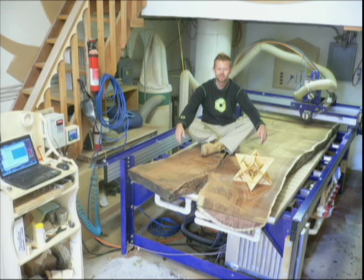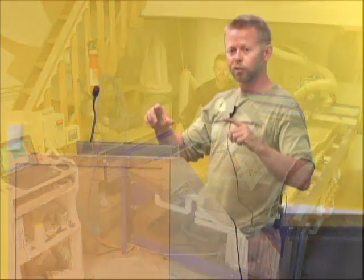The slab had an enormous crack right down the center, so I cut butterflies — bow-tie shapes — out of wood and also cut a template for the other woodworkers to route the holes for those butterflies. The crack was sewn up and it looked like a giant zipper.